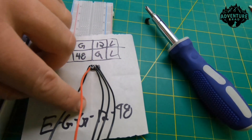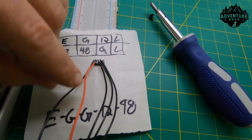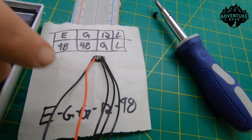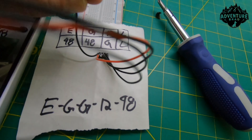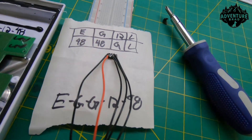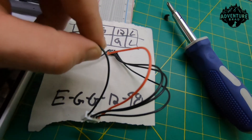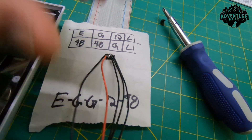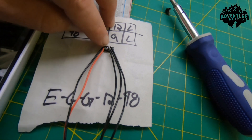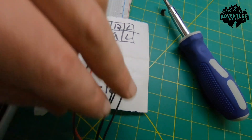For the earth pin, there's a little bit of resistance to the ground pins, but I'm going to run this to the chassis of the truck so I have a proper earth. That will be my earth for stationary use or on the road — I just felt like I needed it. The 48V pins are shared together, the grounds are shared together, and 12V comes out here.